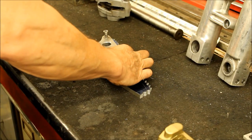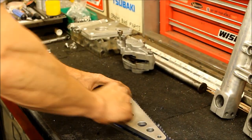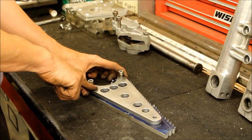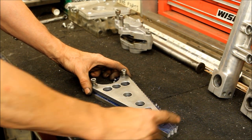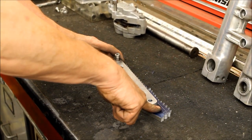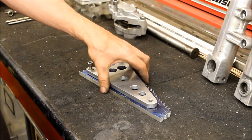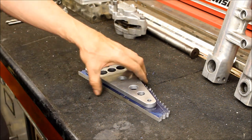Well, I've now got this. What I need to do, because that's 3/4, is make a little pin to go in there to hold it while I get the shape. Mark these two, so I know they're in. But like you said, we want to come about another 20mm longer. So I've left that from there to put our new holes. Once you've done that, you can get it on the miller. Once I've done that, I can just whip round it, and it's done. I've set everything up there. One little job, admittedly, but it's just one small little step for mankind.